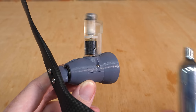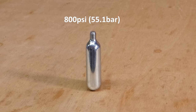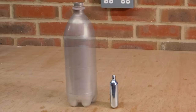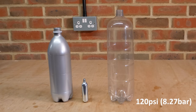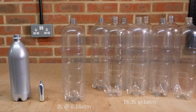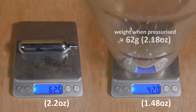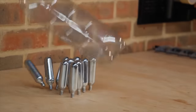Many of you are thinking: why don't I use CO2 cartridges instead of plastic bottles, as they can store far more pressure? Well, this CO2 cartridge is pressurised to about 800 psi, or about 54 times atmospheric pressure — which is a lot, but its volume is very small at just 21 millilitres. So if we let the CO2 gas flow out of the cartridge to equalise at 1 atm of pressure, we'd have just over a litre of gas. But if we pressurise a 2 litre drinks bottle to 120 psi, or about 8 times atmospheric pressure, we can store 16 litres of air. This means we'd need 14 CO2 cartridges to match the storage capacity of the drinks bottle, and considering the single cartridge weighs more than the bottle, the air storage to weight ratio is over 14 times greater for the drinks bottle. So moving to CO2 cartridges would be a huge downgrade.